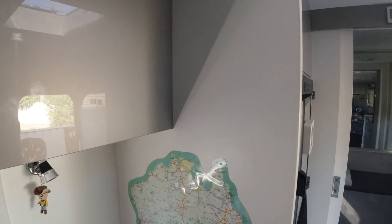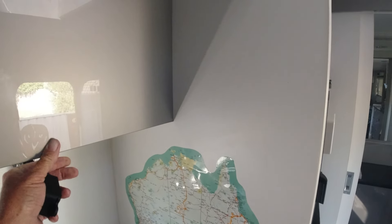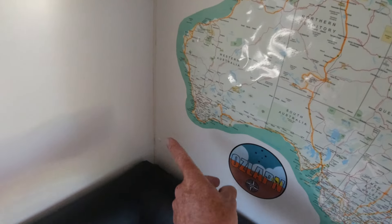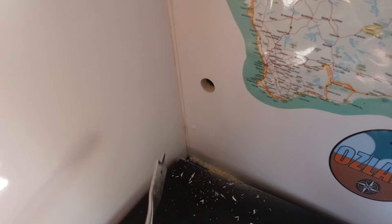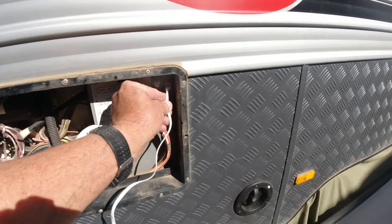So I'm about to put the remote in and I'm just considering where I'm going to put it. I was thinking here, but obviously that cover would be in the way. Because I'm going to go down behind the fridge, I think I need to keep it as far that way as possible. I'm thinking just about there, so I'm going to do my 22mm hole just there. I'm going to check to see if I'm hitting anything. Nice neat hole. Now I've just got to get this connection, which actually goes back up to the top of the fan, up in here and through the hole.